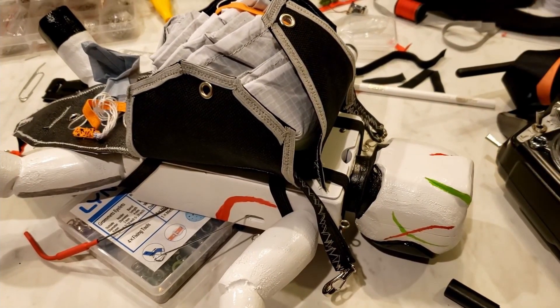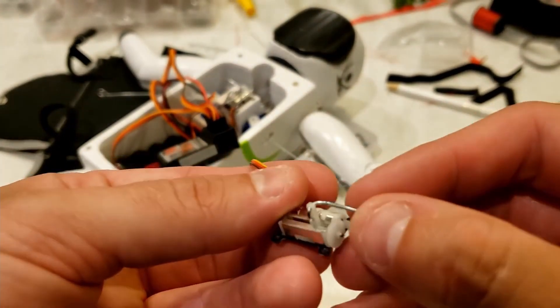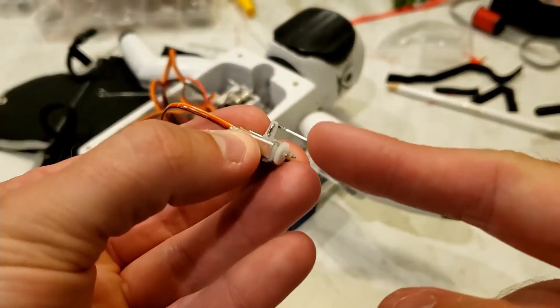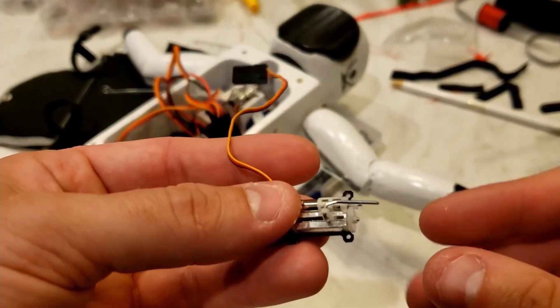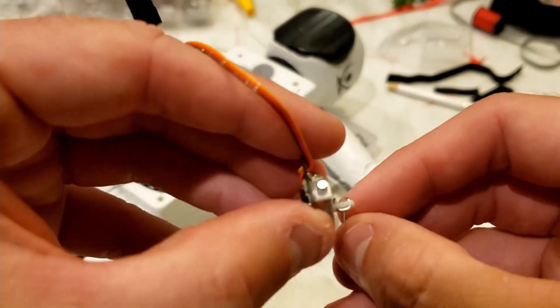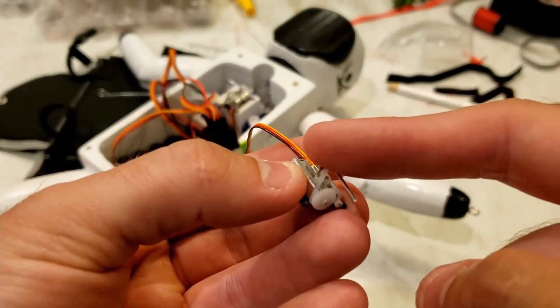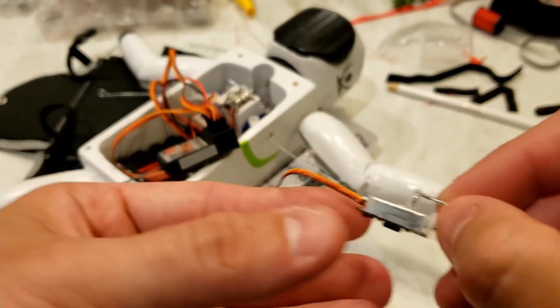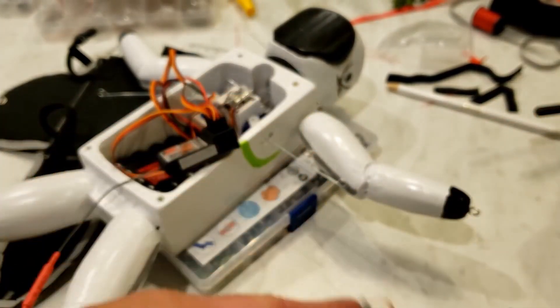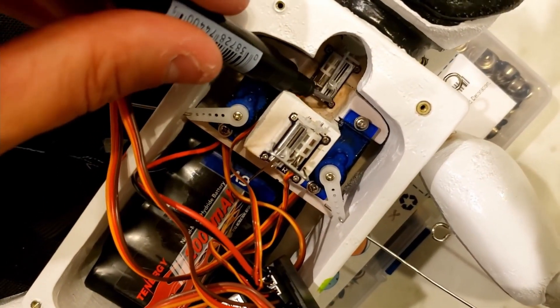Once that was taken care of after a couple hours of tinkering, I was ready for test number two — and finally. To fix the problem I switched the pin from a secured piece that doesn't move up and down, which puts a lot more pressure on the arm and burned out the servo I'm holding, to one that can move up and down, which creates less stress.